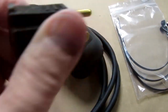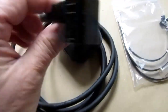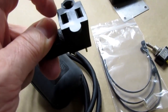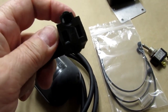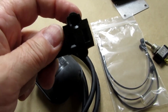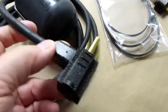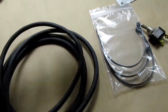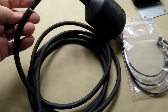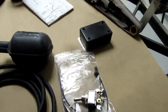Here's the pass-through plug outlet: this plugs into the wall socket, and the load — normally a sump pump, but in this case the belt sander — plugs in here. One of the leads, probably the hot lead, is run through this cable into the float switch and back. All I need to do is cut off the float switch, terminate it to this toggle switch, put it in this project box, and mount that to the workbench in a more desirable location.